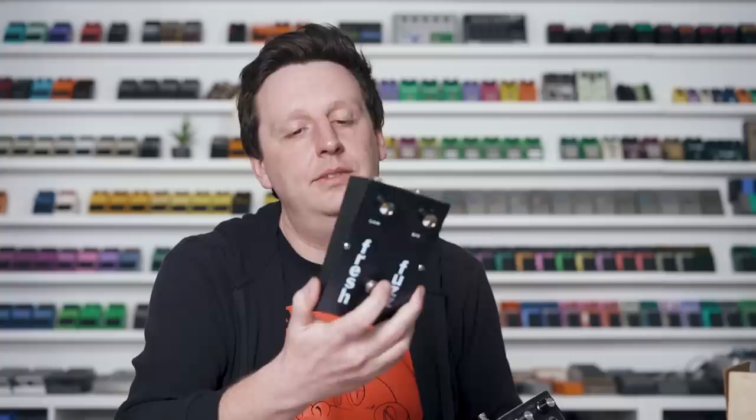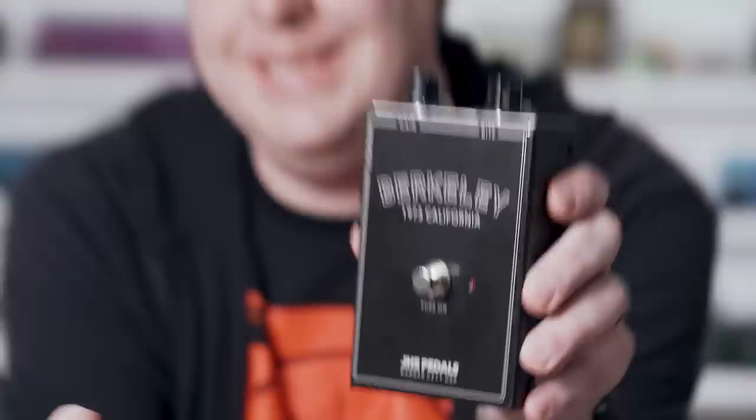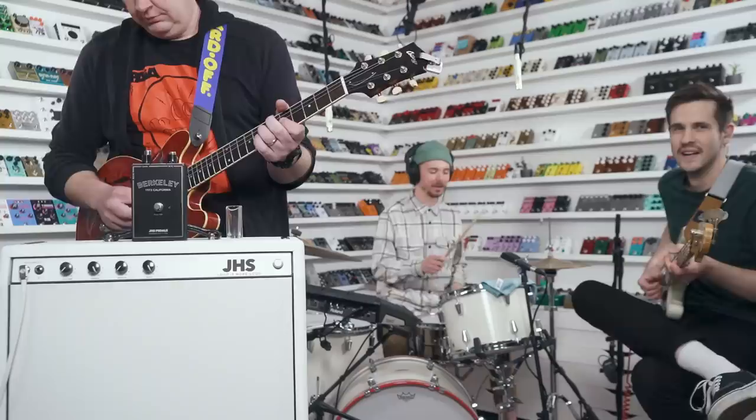When the Legends of Fuzz series originally launched, it featured four fuzzes people kind of knew — a Tone Bender, a Fuzz Face, a Big Muff variation, a Super Fuzz — and the Jordan Boss Tone. The Berkeley gets more obscure. This line is important not only for making famous rare fuzzes accessible but also as a platform to introduce things you may have never heard of. The Berkeley has two controls: bite and gain. It's almost like a distortion because it uses an operational amplifier circuit — gnarlier than a Distortion Plus. The JHS mode button adds a capacitor that brightens the rather dark nature of the circuit.